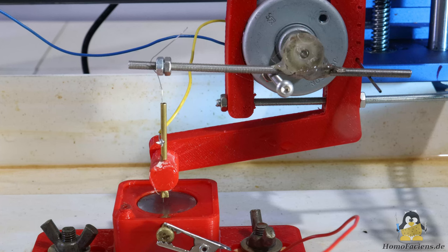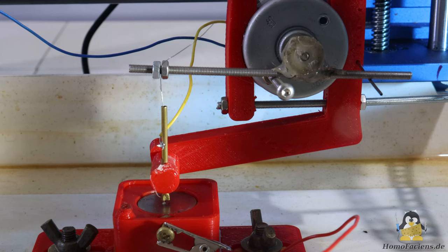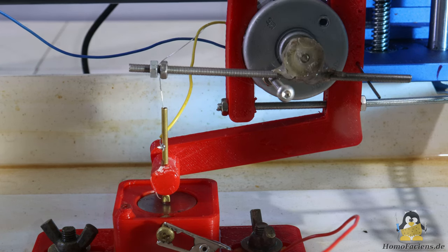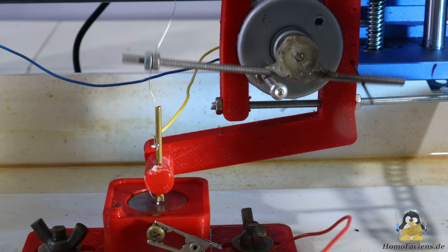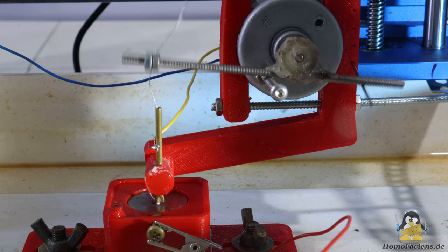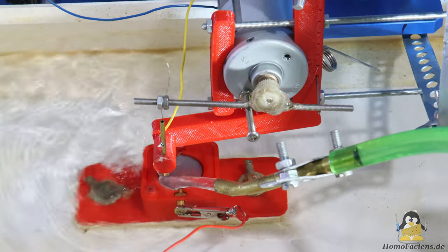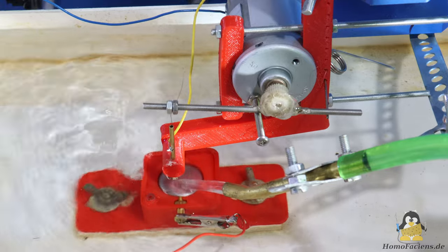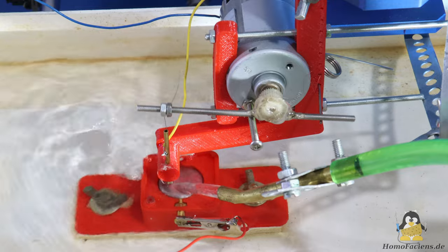With this motor I noticed how important the adjusted spring tension is and that the system must move with as little friction and as little backlash as possible. During the first attempts, the motor vibrated strongly and was therefore unusable for engraving. The downforce of the electrode will rise with the height of the Z-axis of the CNC, which can be seen and heard. If everything is set correctly, this motor also works as a Wagner hammer at 12 volts.